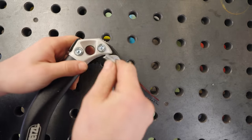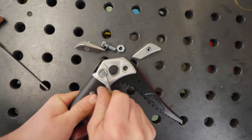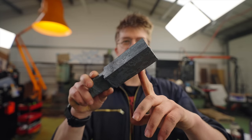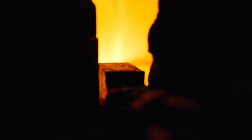Let's have a look at what the pick actually looks like. And there we go, that is what we've got to make. The steel that we're going to be starting from comes from our last episode's project. The bar currently has this beautiful W's pattern, and we're going to forge it down, grind it, cut it, and restack it to keep making it more complex.